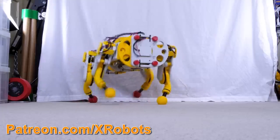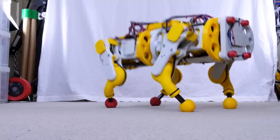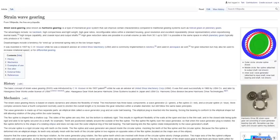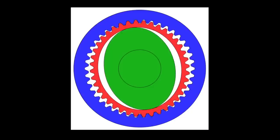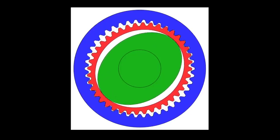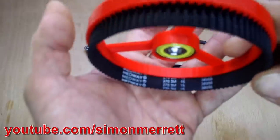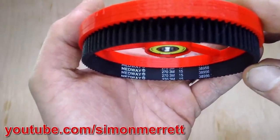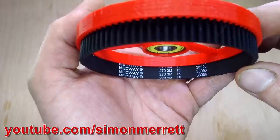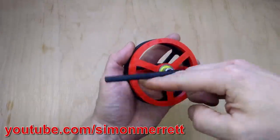I've been looking at other types of innovative drive reductions and this time I'm going to attempt to make a 3D printable strain wave reduction or harmonic drive. A strain wave reduction uses a flexible spline which is deformed by a wave generator attached to the input of the drivetrain. This runs in a ring gear with teeth facing inward and slowly rotates as the wave generator deforms it. There are already a few videos on YouTube about 3D printed strain wave reductions — Simon Merritt did some development a few years ago using an inside-out HTD profile belt as a flexible spline.